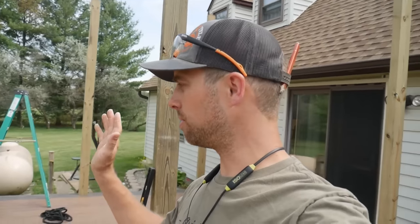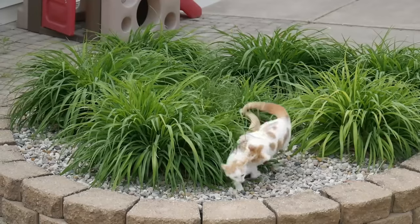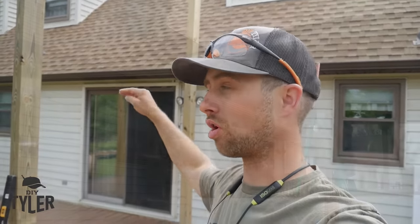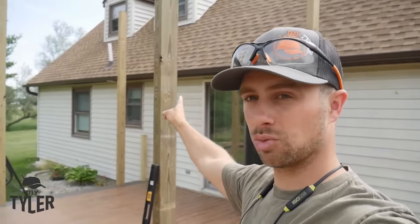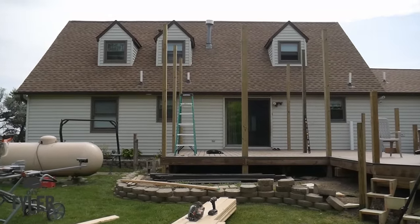The pergola plan is going to be built in two different sections. I'm going to put the lowest point on here, then run our boards up over the roof to keep the water out — overhanging and cantilevering over the roof line. We're going to have a double header two-by-six beam in the front because we are spanning a total of 13 feet, then cut angle pieces connecting between that double header beam in the middle and each end to get some good joist hangers in there.